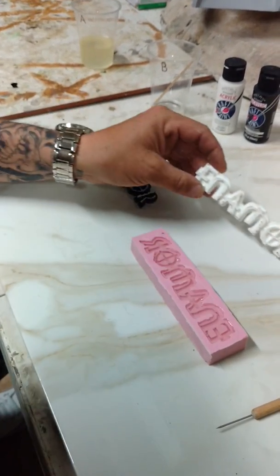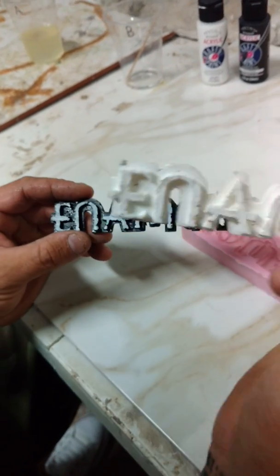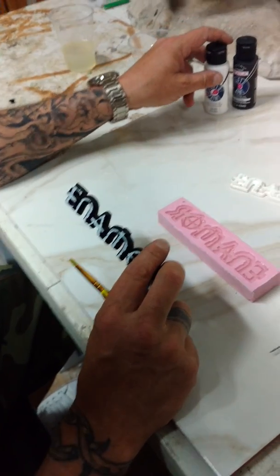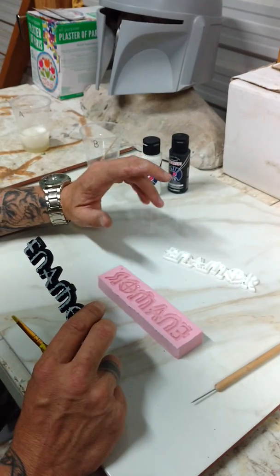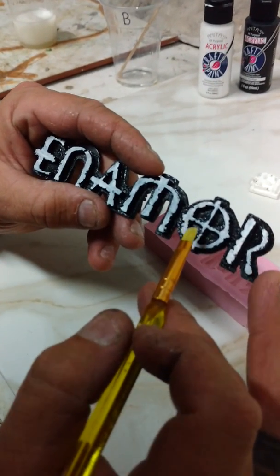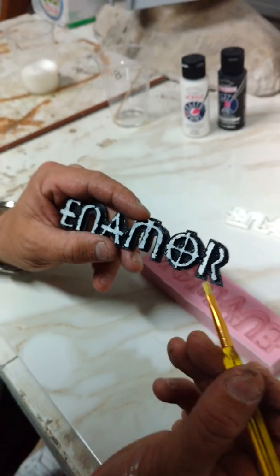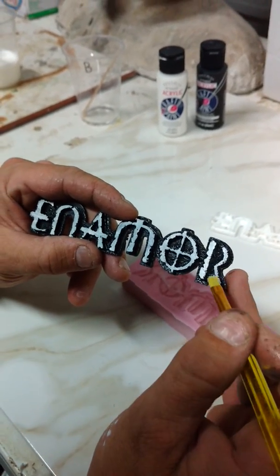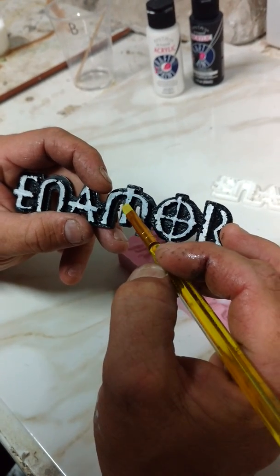We're going for the rough look on the inside. I went ahead and painted one of these for you, and I'm going to tell you how I did it. I basically took this whole plug and painted it black with a rattle can spray paint. I let that cure, and then I came in with a brush — you can paint plastics and resins with just a regular acrylic paint, which is a hobby paint, or you can use enamels like they use on model cars. Enamels are a lot harder whereas your acrylics are a lot softer; I just used acrylics because that's what I had. Because this has that rough look to it, you don't want to just start jamming paint in here because you're going to lose your detail. I'll dip just a little bit on the brush and feather it across, because I don't want paint ending up in the cracks — that's the whole look you're shooting for. So I'll dip some paint and just drag my brush real lightly across the top.